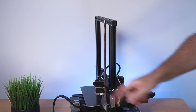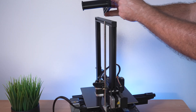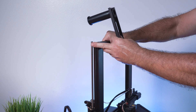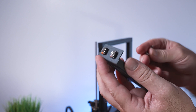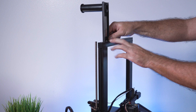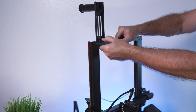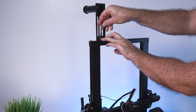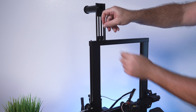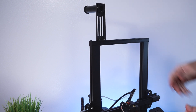For the spool holder, it goes on top. Looking at where the extruder is, that's where the filament goes in, so the spool holder needs to be positioned closer to the lead screw. We're working with T-nuts again, so loosen the bolts. Position the spool holder toward the back as far as possible, unscrew then screw in each bolt so the T-nut turns and locks in.